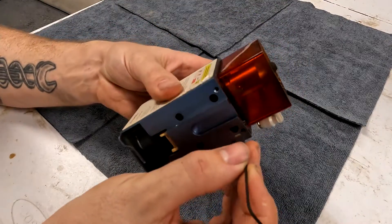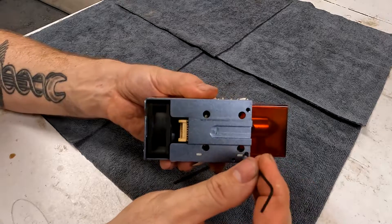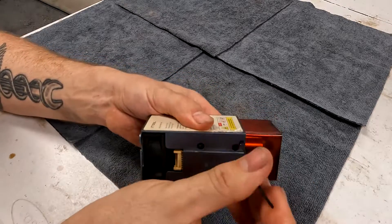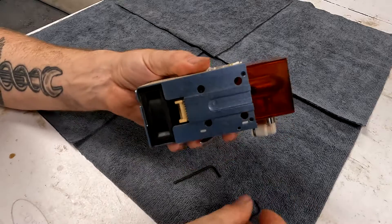You should have had a couple allen tools come with your X-Tool D1. If not, this is a 1.5 millimeter allen wrench. We're going to loosen up the shield around it — this is the vision shield on it. Some people have thrown these away, I've still got mine on there. Loosen these up but don't have to take them all the way out, just loosen them to the point where you can slide the shield out.